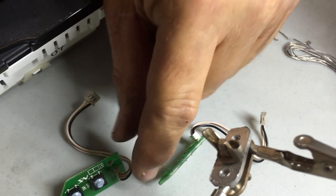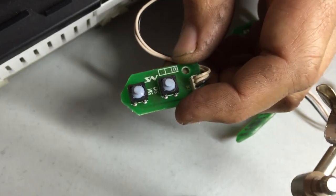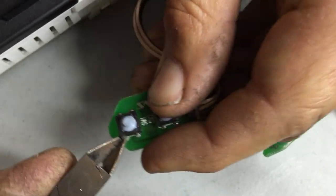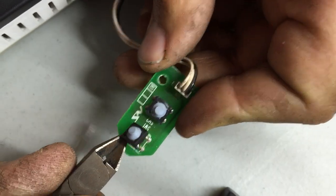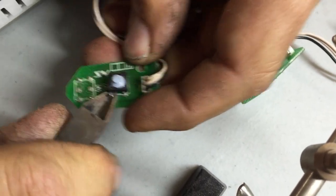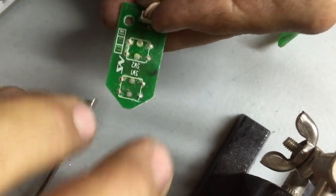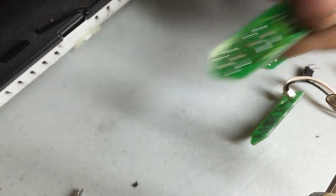Here's the circuit board that we're going to use as a demo. To remove the buttons from the circuit board, it's easiest to start with a small pair of wire cutters, and you actually want to clip the corners of the little legs off of the buttons and get them out of the way. You're going to go around and just get the button out of there like this. Then, once you get the button off there, now you have to either use a solder iron or a device to remove the little legs off the back of it.